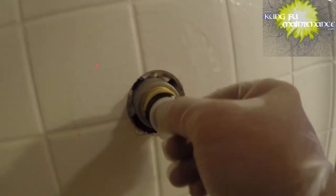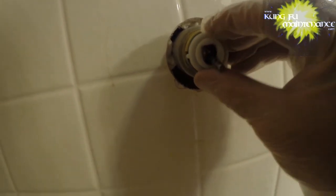Re-seating the ball here. I'm going to lube the back of the ball — put lube on all the surfaces that it moves around on. This ball has a groove in it, so just lining up that groove. That's all the way in. Then the seal here has a groove in it as well — line up that groove and press that all the way in. Now it operates nice and easy.